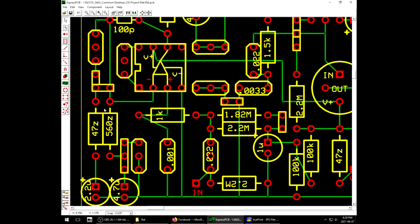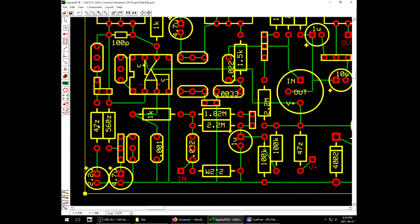Now, one modification I found online that I didn't have loaded up in time for filming here shows that if you disconnect this 47 circuit, you can start tweaking on the 560, because some people might find they don't have enough bite if they disconnect that 47. And what you would tweak on would be this capacitor value here, the 4.7U. So again, I have another triple jumper, connects between stock or a modified situation where I have another socket and I could pop different capacitors in there.